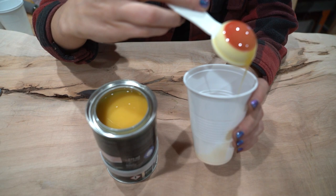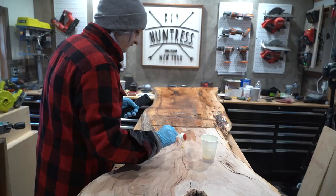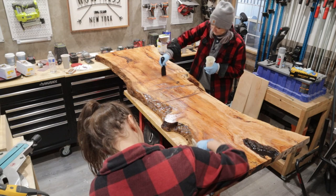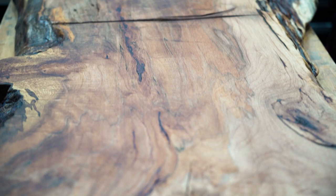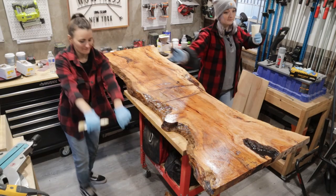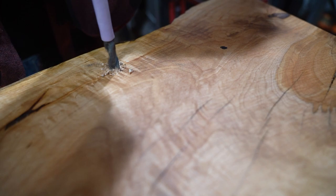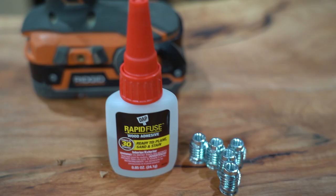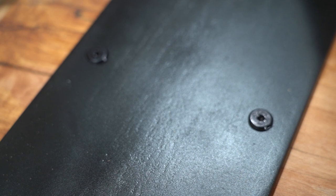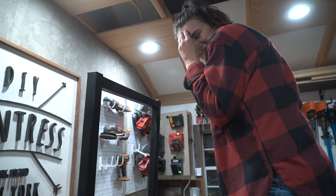Using that good old DIY teamwork, we got going on sanding both sides, working through the grits to make that tabletop super smooth as butter. Starting on the bottom of the table first, we used a finish called Rubio Monocoat — it's an oil-based finish that includes an accelerator added in a 3-to-1 ratio. This brings out beautiful color in your wood while leaving a hard top coat to protect it. A little goes a long way spread with a flat edge. Before we flipped, it was time to add the DIY welded black legs onto the slab — drilling them out and adding threaded inserts with wood adhesive. These threaded inserts really help keep screws in place and your board from splitting over time. We also added plastic table leg inserts to the bottom to close the holes and protect the floors.